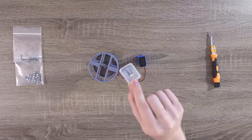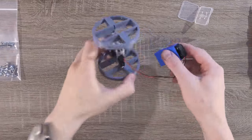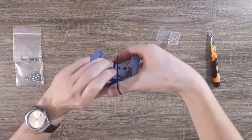We need a microSD card — this is a blank one that I got brand new — and we're going to insert it into the back of the flight computer. Then we're going to manage these wires a little bit by wrapping them around the battery, putting the battery on the back of the flight computer, and securing the whole thing with a rubber band.